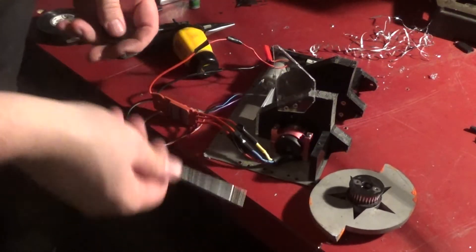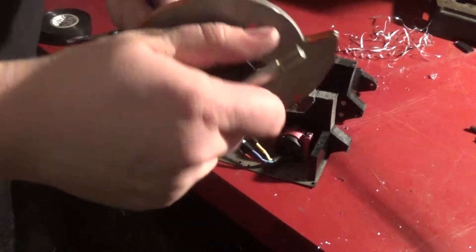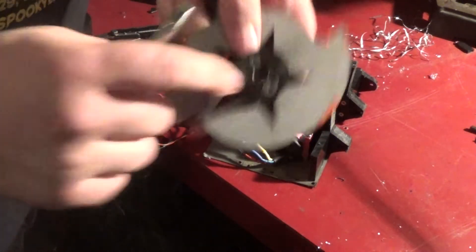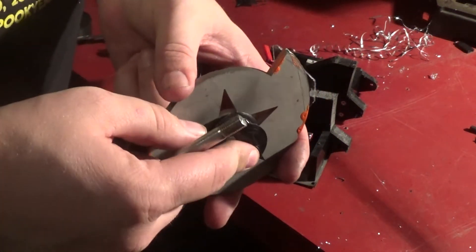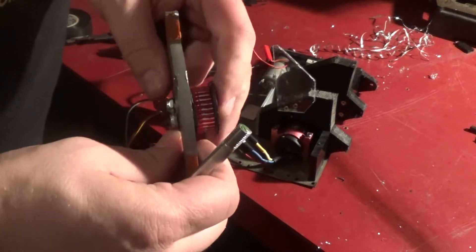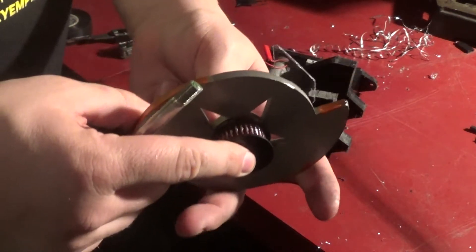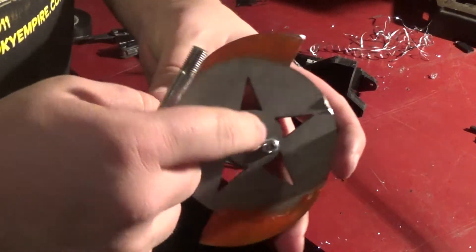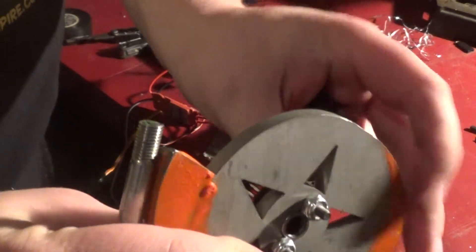The basic layout of the whole weapon assembly on Demon Spawn is this weapon - basically the Fingertech pulley, the hubs that came off of the kit I used with Sawwin, the Fingertech beater bar kit, and my custom blade. There are now two bearings going through, 5/16 bore, a half inch outer diameter. They have two bolts going through that actually hold the pulley onto the weapon.